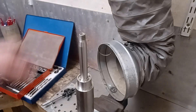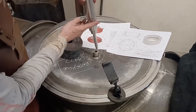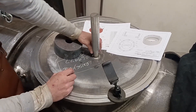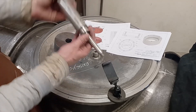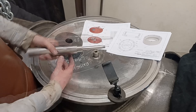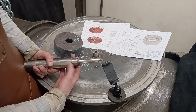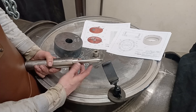After all that's not actually turned out too bad. Let's actually see if it fits — which it does. I've forgotten to break that edge, but with the O-rings in that'll be fine. And there's my extra O-ring on the other side on top. That needs to be parted off and have some squares put on it, and I need to put the flat on there.